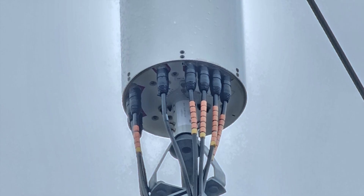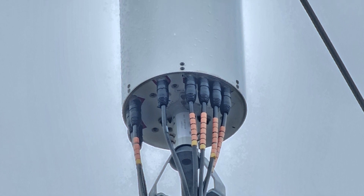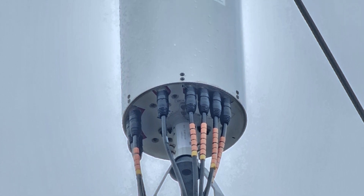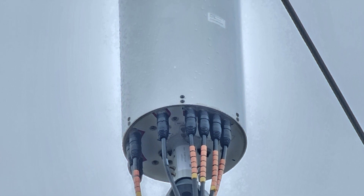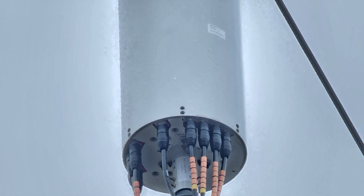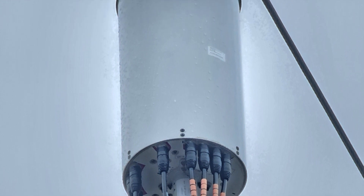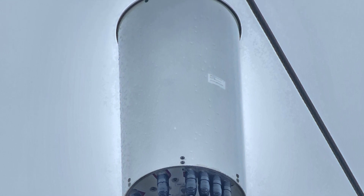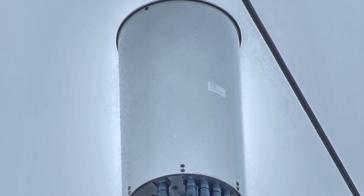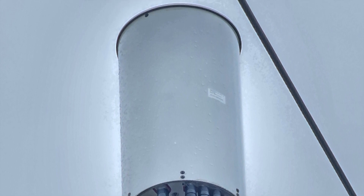This right here is the antenna, which is an omni antenna also known as a cantena for its can look. This supports 8T8R C-band — you can see the 8 ports that are plugged in at the top. This also supports CBRS, 2100 MHz, and 1900 MHz. But as I said, this is only a C-band small cell so only the C-band ports are actually plugged in. And this is made by JMA.